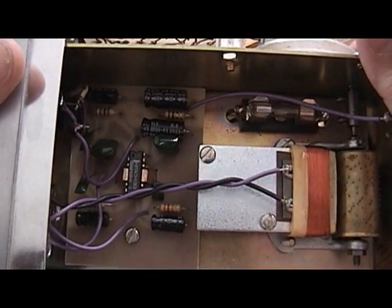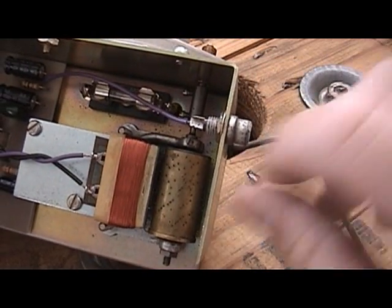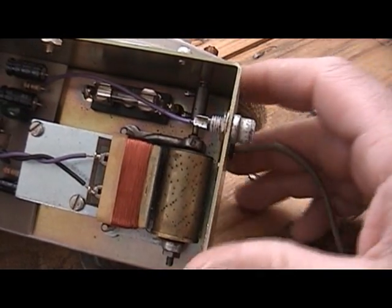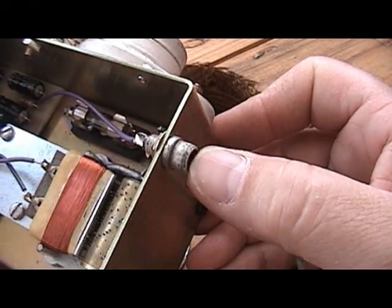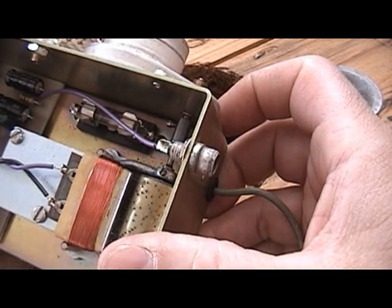I'm curious. Definitely. It's a simple design with a fuse that goes right to the power lead in the back. You hook a ground wire up to here and you just hook up your power lead. It runs on 12 volts. It's got a phono jack output, which is a speaker output. It went right to a horn speaker on the outside of Dad's truck.